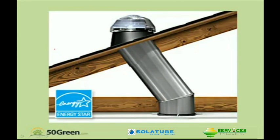This is what a solar tube looks like. Solatube — S-O-L-A-T-U-B-E — is the manufacturer of the most common unit I've seen. Basically, it's a little dome that sits on your roof. This is a cut section we're looking at. Here's the dome. The sunlight comes in and you can turn this dome — it doesn't have to face south. There's a reflector in the dome, so you turn it to accept the sunlight. Then the light bounces off this highly polished mirror-like tube, which brings the light right down inside your house.